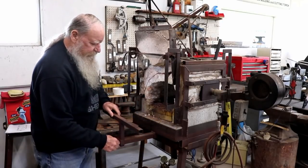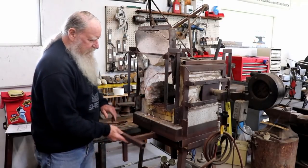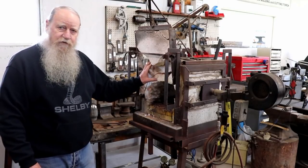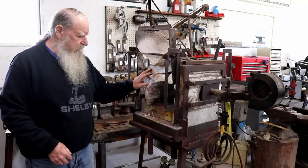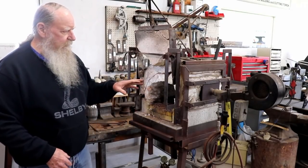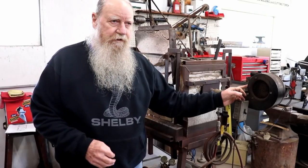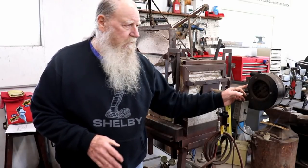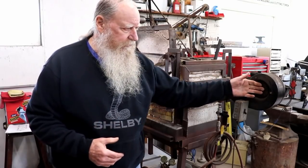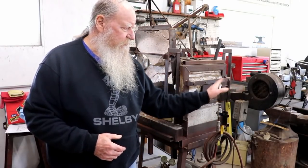It has an adjustable rest that is even with the floor, or I can get it out of my way like that. The top is two layers of 2-inch Inswool by AP Green. I pour my own bases. This is all castable refractory. I make all the frame. The blower is 150 CFM with 60 inches of water column. That way, when I use the slide gate, I don't gain any back pressure and make it back up through here. All of it still goes out through the forge. I made the cone going from square to round.